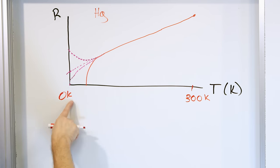We see that in an electric circuit as heat. The wire will begin to heat up. If you think of your toaster oven, electricity is going through it, it gets very, very red hot, or a light bulb getting red hot, that's what we call ohmic losses, power loss due to collisions, due to frictional heating there as the electrons flow through, right? But the electrons are losing energy as they propagate through because of this collision process.